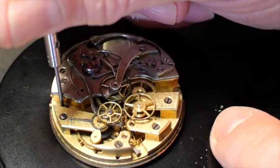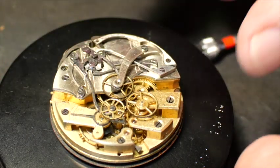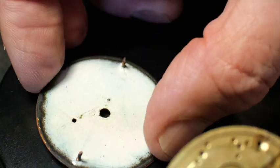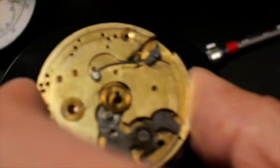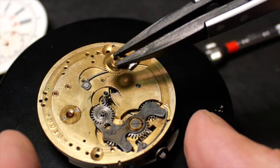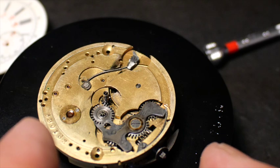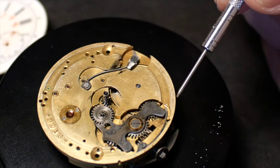Mark those two dial screws so that the crescents are right over the posts — that allows it to just come right off. Do not pry these. It looks in great condition; it looks like an original. It looks like this watch does have a serial number, and we'll get to see if it is a complete watch or a Franken watch. I think this was just a neglected watch — somebody tried to oil it.